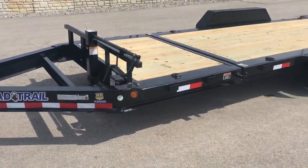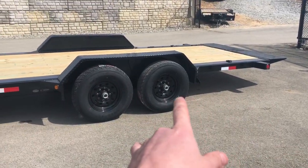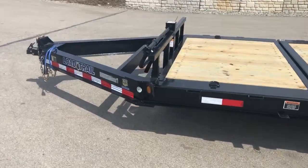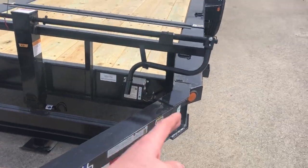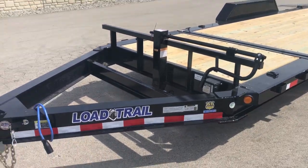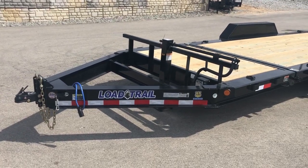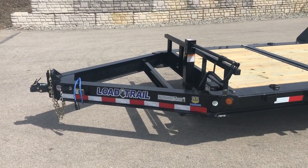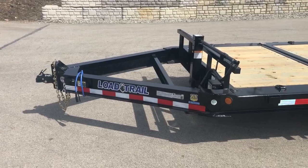One nice thing about tilts is that on an equipment trailer, your axles are going to be about a foot and a half farther forward. So instead of a traditional tongue that comes in about a foot to a foot and a half from each side, this one goes all the way to the outside. That gives you extra stability by being wider on the frame with a unibody design. It also gives you a longer tongue, which brings tongue weight back to a normal amount for a better ride quality. The longer tongue also gives guys with dump truck style bodies extra maneuverability and room.